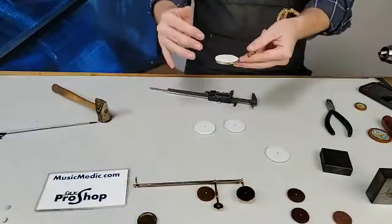This one, again, if you want to, you can go ahead and check, make sure it's level. It's so tiny. Yep, it's level. Okay, just to double check. And again, I'm checking the inside diameter. This is measuring, let's see here, north-south, 8.96, east-west, 8.81. Okay, so around a 9 millimeter ID.